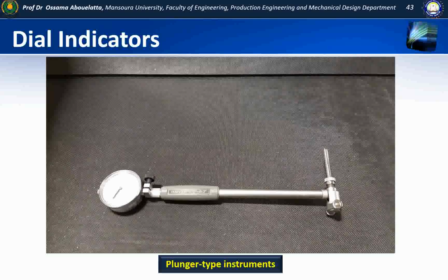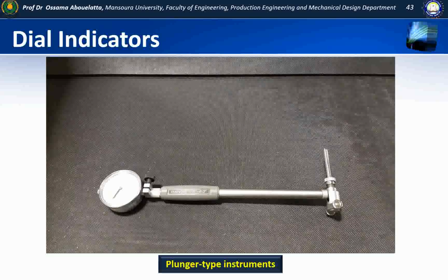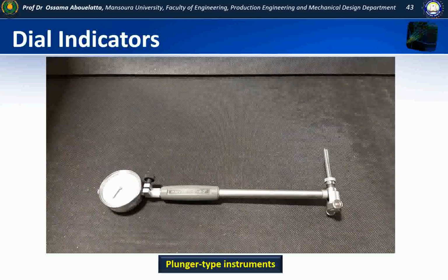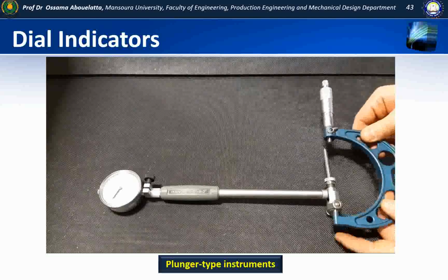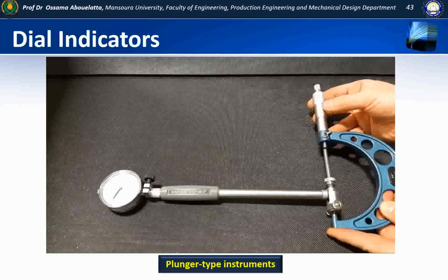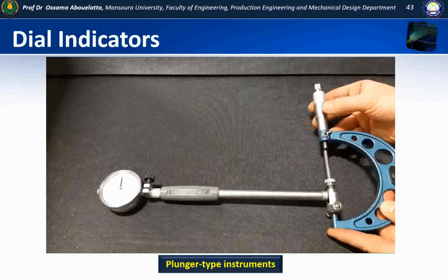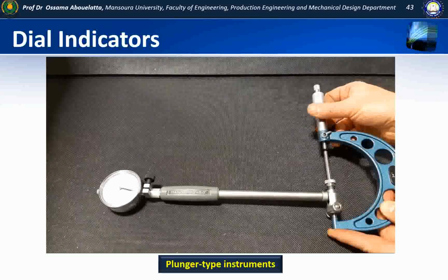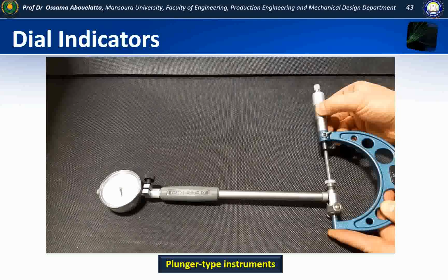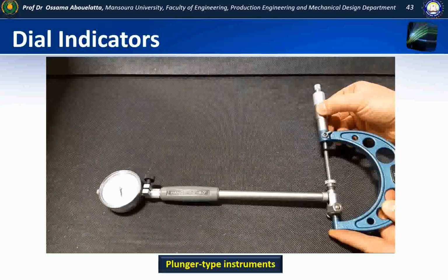So I've turned my dial indicator 90 degrees so that the bore gauge will lay flat, and it'll make this next step a little bit easier. After I did that, I reset my zero at my point of maximum wear, top of the ring travel, 90 degrees to the crank center line. To find out what the actual bore measurement is here, I'm simply going to take an outside micrometer to the bore gauge, and I'm going to use the mic almost like a clamp to squeeze the bore gauge and turn the indicator back to the zero. This is why it's very important to make sure that when we're setting our bore gauge up, it doesn't go all the way around more than 360 degrees. If it does, we're going to have to keep track of how many turns, and it just makes this step more complicated.